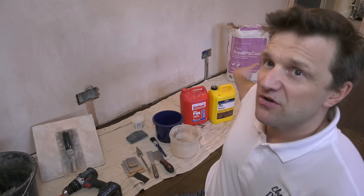Before I start, I should point out this is an internal upstairs wall that has been previously rendered and plastered back in the 70s. I'm not worried about damp up here. If you've got an external downstairs wall with damp problems, you don't want to use bonding because bonding can attract damp. If you're worried about breathability and you've got a lime-based rendered wall, my suggestion would be to fill your chasers with a lime-based render. Alternatively, if it's not lime-based, you can use a sand and cement based render.